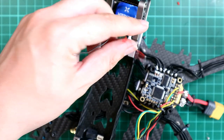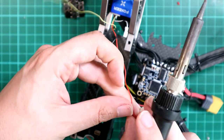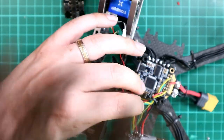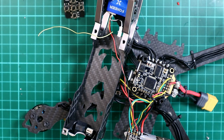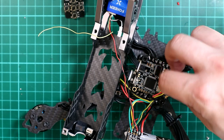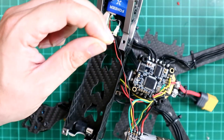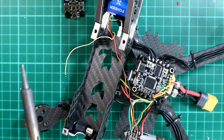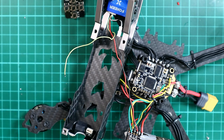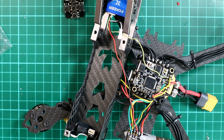So you don't need to hear me say clip the ends and trim solder again on those — I'm not going to tell you again. All I'm going to do is connect the 5 volts here to the 5 volts on my board. This cable here is where the video transmitter goes to, so we're just going to trim the end, tin it, and a little dab of solder on the end to tin the wire. That should now be everything soldered up.